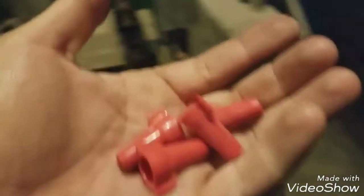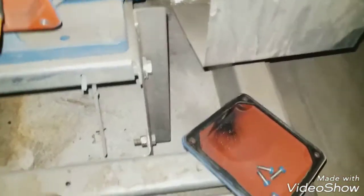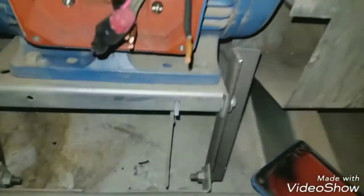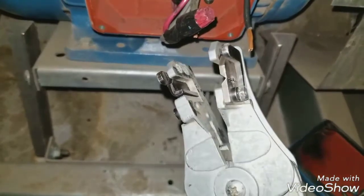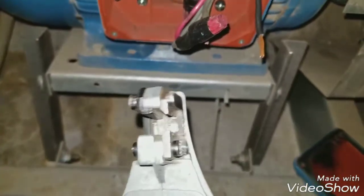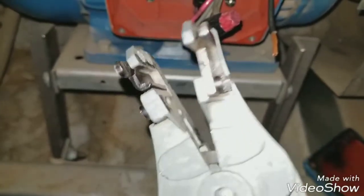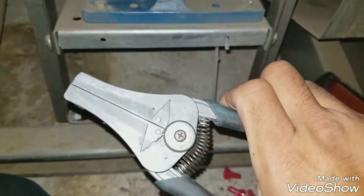All right, I had to get some wire nuts. I'm gonna go ahead and install them. I went ahead and splice my wires nice and clean. I'm gonna show you what I used to splice them — this right here. I love this thing, I've had this forever. I used to use those combination ones but I didn't care for those. Sometimes you have to do stuff live. This cuts and strips all at the same time, and it's pretty well insulated right there — don't touch any of the metal stuff and you should be fine.